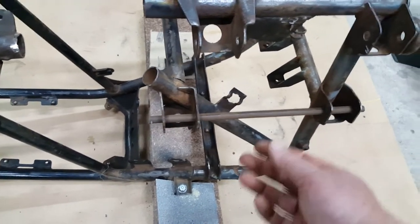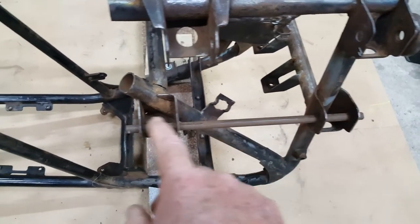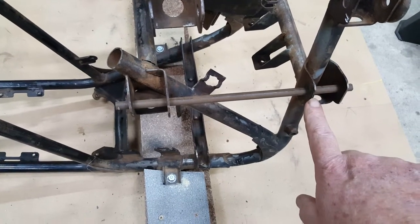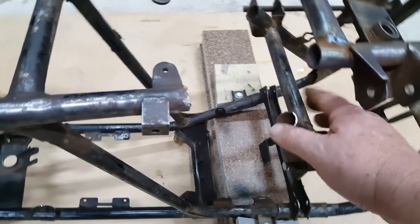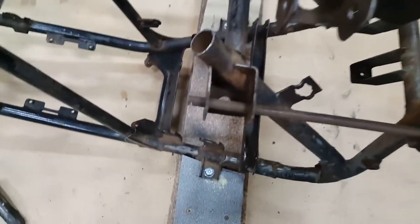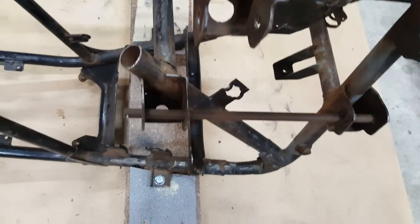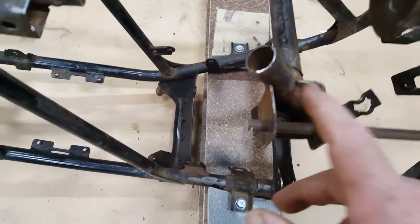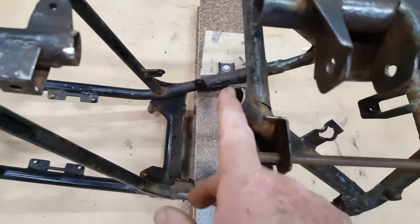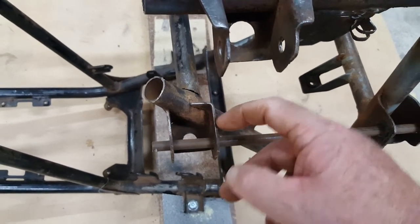I could work with the 10 millimetres — prior to the modifications I've made, this rod would not go through both those clevises like it does now. It was out of alignment by at least 10 millimetres, same on the other side, because that bar joins both sides together. This frame coming from here, continuing around as one continuous tube, was belted out of alignment by at least 10 millimetres.